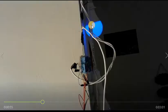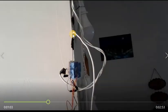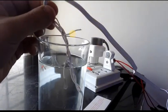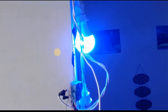One, two, three — it indicates the water level with three wires in the tank. One wire is out of the water. It blinks three times indicating all three wires are submerged. Now the second wire is taken out of the water and the bulb blinks twice — one, two — then a gap, indicating the tank is half full.